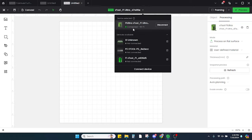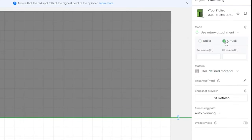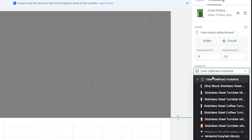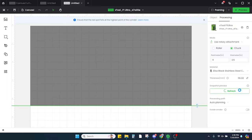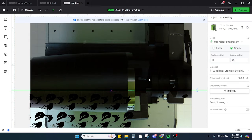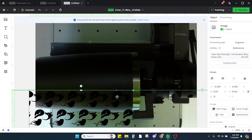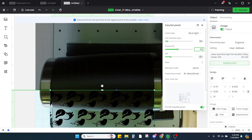Now the software setup is pretty much the same. I'm making sure I'm connected to the F1 Ultra, then I choose the rotary attachment but this time select 'Chuck.' When you use the chuck, you're required to input the perimeter or diameter. I choose the 20-ounce black tumbler, but that clears the perimeter field so I put that back in. Then same thing — we measure the thickness and refresh the camera. With the camera refreshed, I'm now gripping from the top of the tumbler because gripping from the bottom put the view off-screen and the rotary attachment wasn't in a good centered position, so I flipped it over.